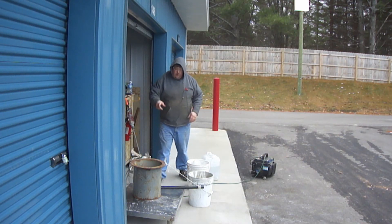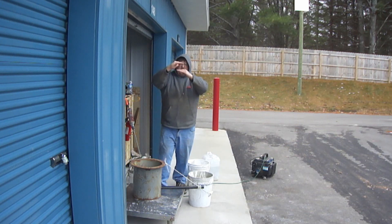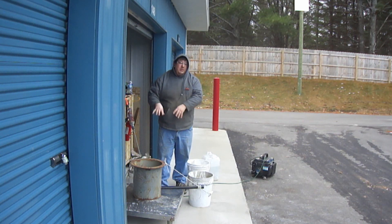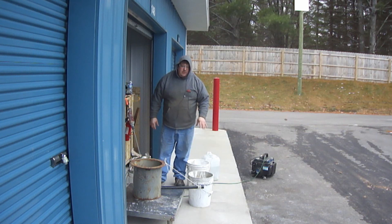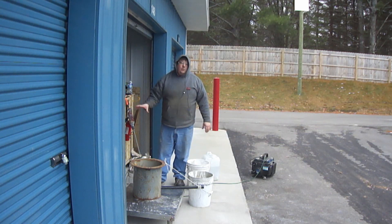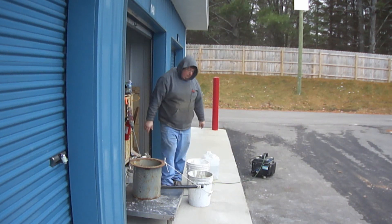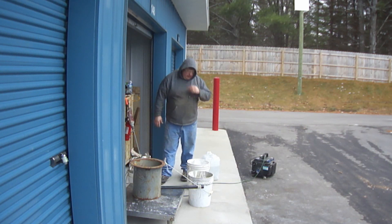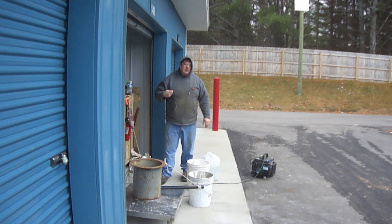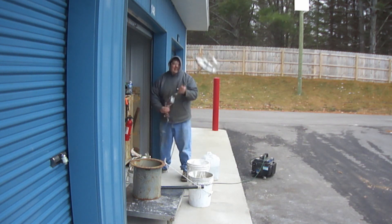I'm ready to start mixing. The first layer is just going to go up to the level of the pipe — the pipe does not get buried yet. This is basically to have a nice heat barrier so the bottom of the pipe doesn't melt and the base doesn't melt. Your mix is a 50-50 blend of plaster of Paris and Portland cement. This is going to be my mixing bucket. Always use a bucket that you are going to ruin and be cool with it, because you're going to ruin it. You can do this by hand with a good stirring rod — a piece of tie rod works well — but if you have a hammer drill with the proper attachment, that would be best.